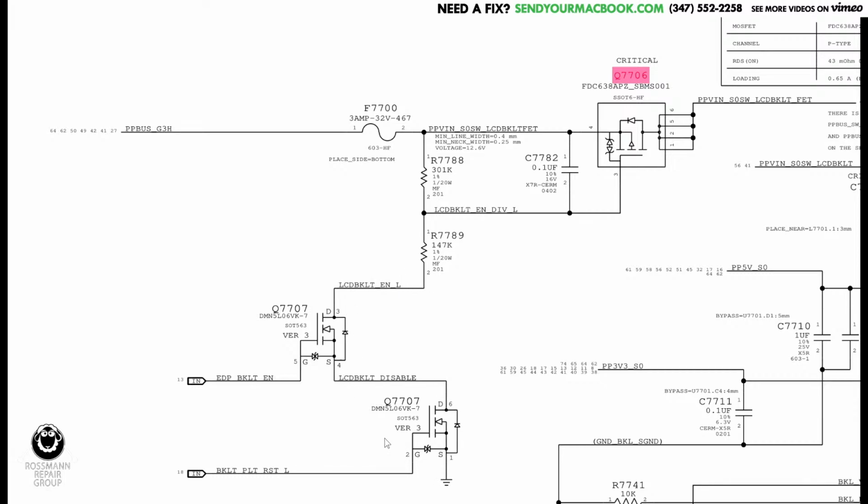So this is just a bunch of switches. These 2 signals over here are going to turn each of these transistors on, so that power is going to flow from source to drain, up, and that means that this will now be a voltage divider. Now, if this is a voltage divider, that means you're going to go from having 8 volts up here to about 3 or 4 volts over here.